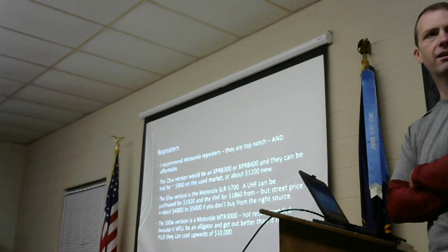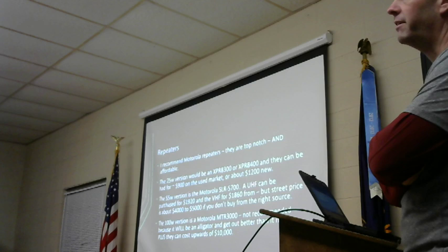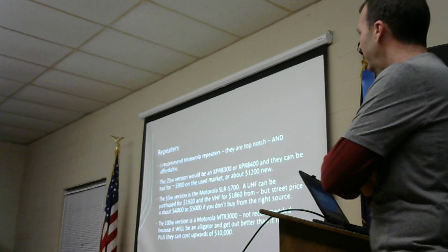What we found is that the 55-watt UHF repeater is about a pretty even match. The 25-watt will hear better than it gets out a little bit, but it's not really noticeable. And the Ozark repeater is one of the 100-watt ones, and it's an alligator. It gets out better than it hears. So really, there's not much of a reason to run more than 50 watts if you want to be matched up between where you can get out to versus where you can hear the repeater.